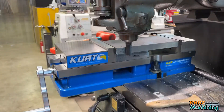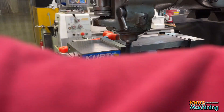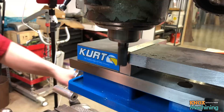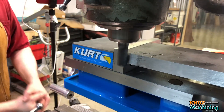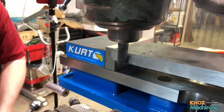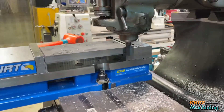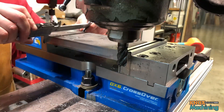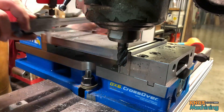Come in and touch off. I'm going to zero out the X and come in about 50 thousandths. A nice conventional cut here. Let me take a quick measurement. I should have done that before — I don't have very much to clean up on the other side.